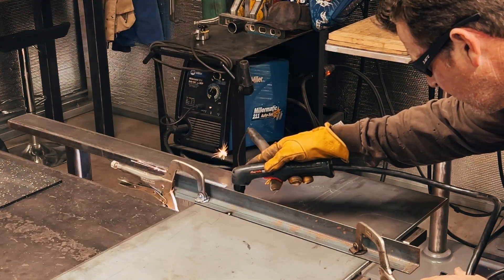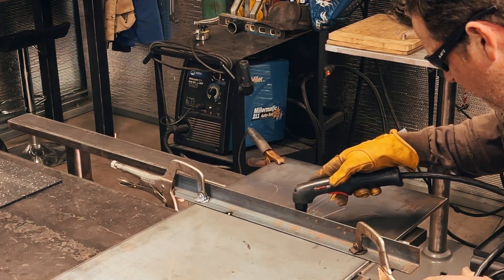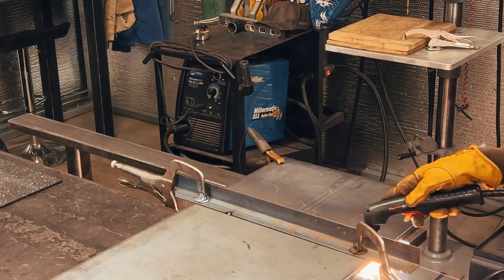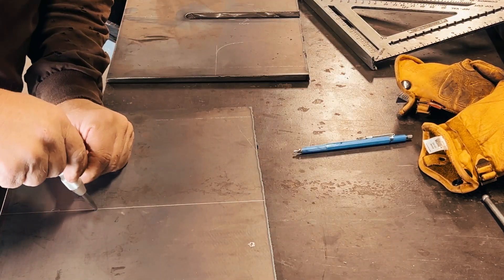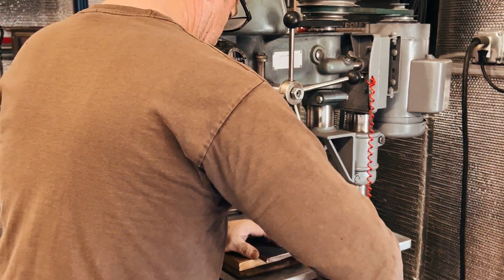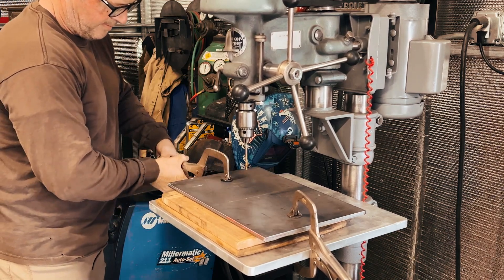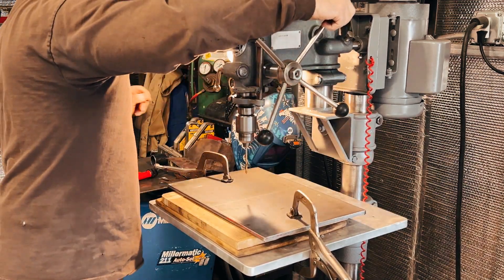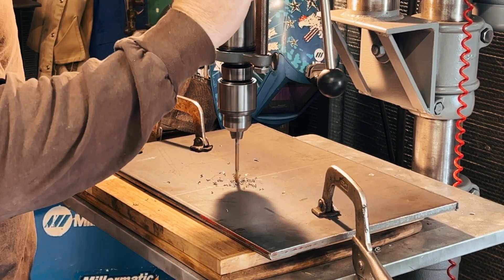Here I'm using a Hypertherm PowerMax 30. If you don't have a plasma cutter, you could do it with a four-and-a-half-inch grinder or equivalent - the plasma cutter just makes it a little bit easier. I'm using a piece of angle iron for the guide to help make that cut as straight as possible. At this point, I'm marking the one-inch hole that I will end up drilling using my new Walker-Turner drill press. Kind of proud of that - it's a 1951 model. I kind of prefer the vintage tools, but it does a good job getting through this three-eighths-inch plate.